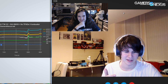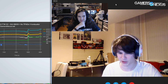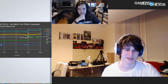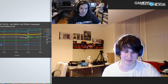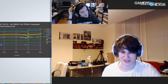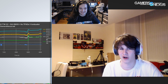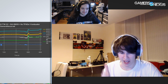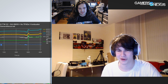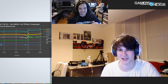Right. So this most recent one as well is just like the capacitors, well, it's not blown to bits, but you can see that the solder on one side of it just got shot right off. So that one's another capacitor failure. And basically all of the other ones are varyingly more severe capacitor failures could cause those exact types of damage. And then along with the fact that EVGA is claiming that, oh, there isn't a thermal issue, right, that would line up with why there isn't a thermal issue. You have a bad batch of capacitors.